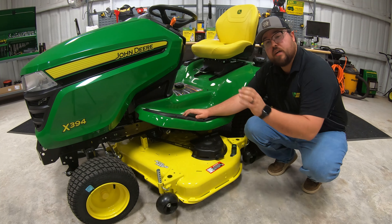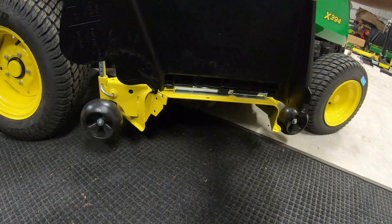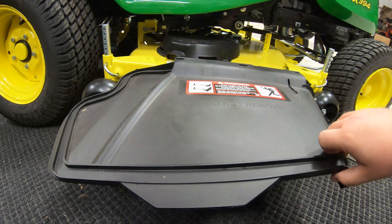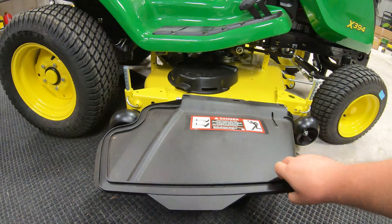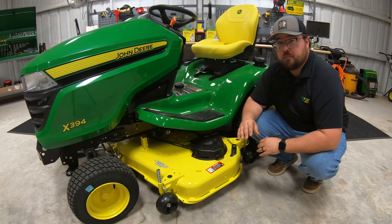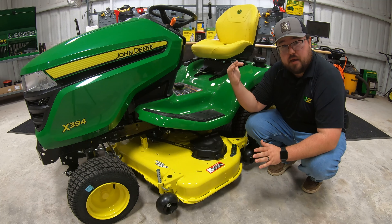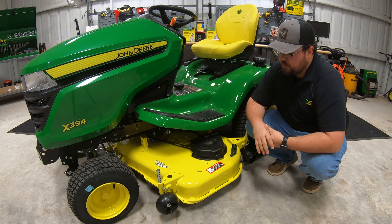On the right-hand side we have a large discharge opening and a spring-loaded discharge chute. If you happen to run into anything, it will flip up and flip back down and stay in place. Make sure that when running these mowers you are leaving the discharge chute on — it's not only a protection for people around you but also for yourself, protecting against material flying out or wind blowing it back on you. Keeping that discharge chute on eliminates some of that risk.